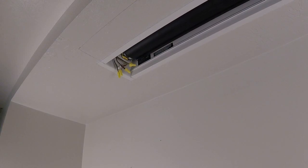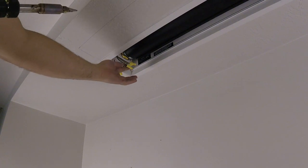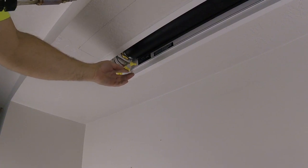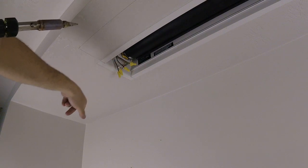Whenever you use two solid wires, you're going to use wire nuts to connect them. If you're going to splice two stranded wires together, you're going to use some type of crimper. In this case, I have stranded wire coming from the projector screen motor, and I've got solid core wire coming from my switch.